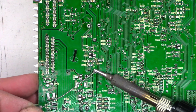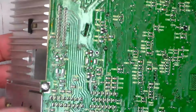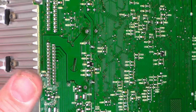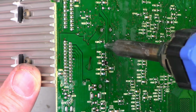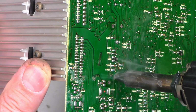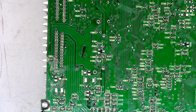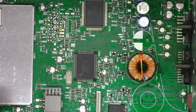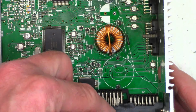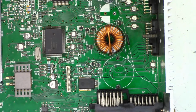Okay, fresh solder going on. Lower melting point than lead-free solder. Solder sucking coming on in once again. And let's put this back in automagical focus. That way you can see it as I lift it up. There you go. I'm going to assume that both of these inductors are the exact same, and I did mark them for directionality, so that little gap right there goes towards the jack on both of them, and they both appear to be identical inductors.